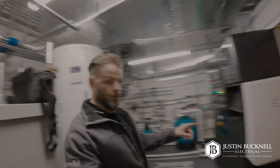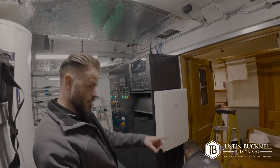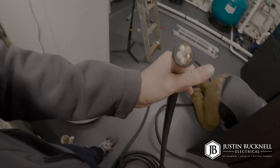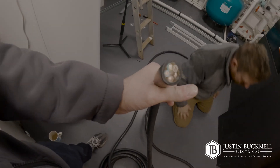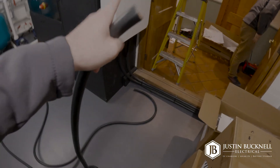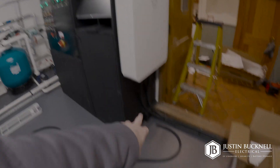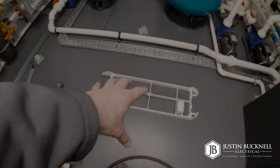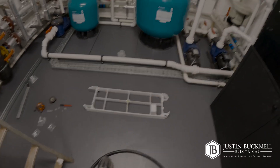The gateway is now up on the wall with the supply going in and the cable running back to the original distribution board. We are now going to be using this multicore stranded HO7 cable, which is really nice and flexible and easy to work with. This cable is going to run from the gateway on the wall, go through the back of this cabinet where we have some good clearance, come around the back using some existing cable tray, and make its way to approximately where the batteries are going to stack.